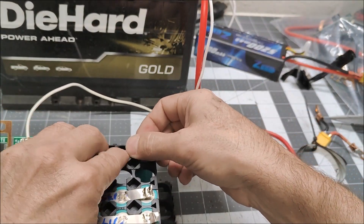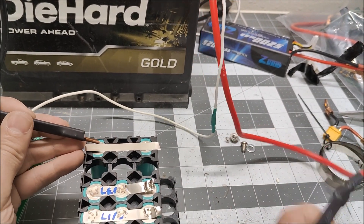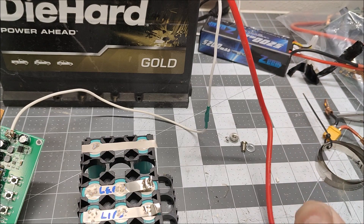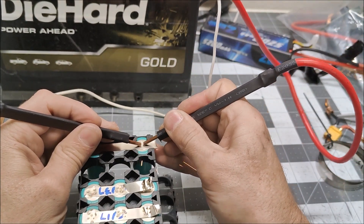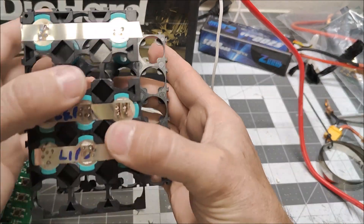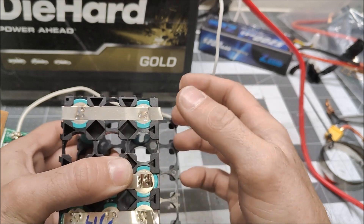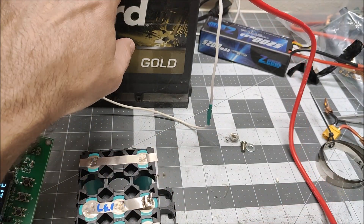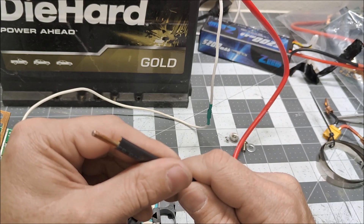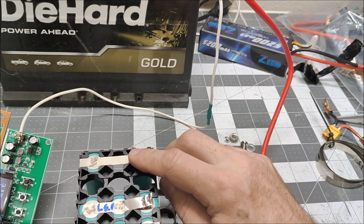Let me show you this spot welding so you can actually see it. Okay, that one was bad — didn't have the needles down quick enough. Let's do another one. You can see how hard that is spot welding — that is a serious spot weld. I've got to decide if I'm going to use lead acid in the future, but this needle is already almost too hot to hold after just a couple more welds. This might just be too much current flowing through.